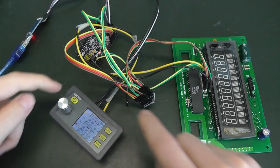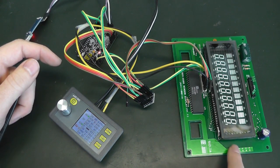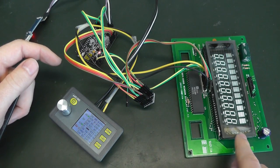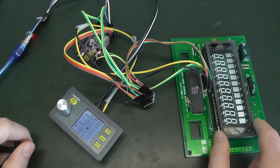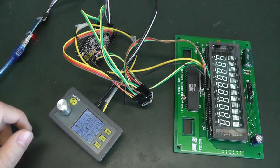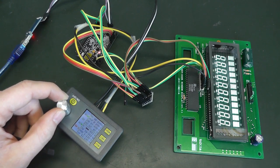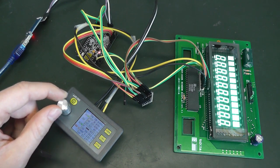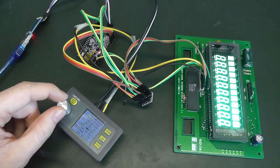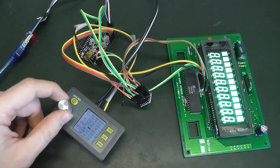ones. And if we enable the voltage, if we enable the power, we can see here that the segments are enabled. Now this is just at 10 volt, and this is why it's pretty dim, but already at 10 volt you can see some light. And if I go higher in the voltage, here we're at 14, 20, 28, and that's the max I can do. And at 28, it is already pretty bright. So let's go back down.